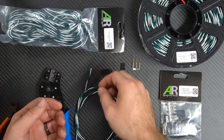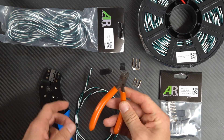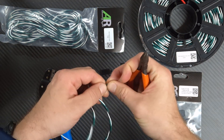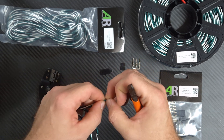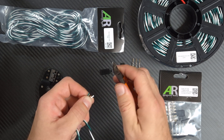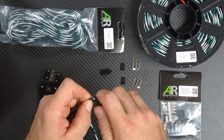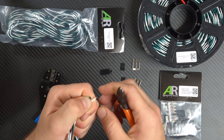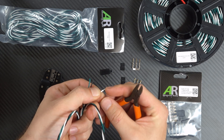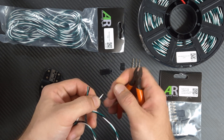The process to crimp is really simple. All you do is get your set of side cutters, obviously measure the length of wire that's required. You can use a pair of auto wire strippers as well, but I tend to like using a pair of side cutters. Then what we do is just pare a little bit off the end there. You can see now that we've got some wire that's exposed — there are little tiny fine wires, and we want to try and keep those together as much as possible.